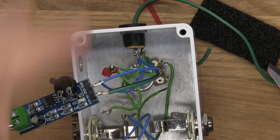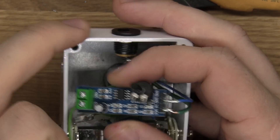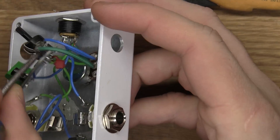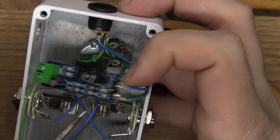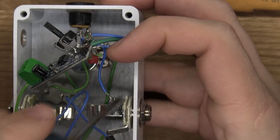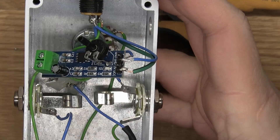Hopefully you can see them. They're just going to the jack, the DC jack, like everything else that I've made. Okay, so the return gets connected here to the out. And the send is connected here. I put them on the back because I cut this off — it goes to the in. And then I put on a ground wire that I just put here on the ground. It's one of these legs here, and I've just attached it to a jack so everything is grounded. That's because the only other ground is this ground here that is going to the DC. But the DC ground is not connected to the rest, because this is plastic. So by adding this ground, everything is grounded. You don't necessarily need to have a bunch of ground wires going in all directions, because the enclosure is made of metal and will ground everything.